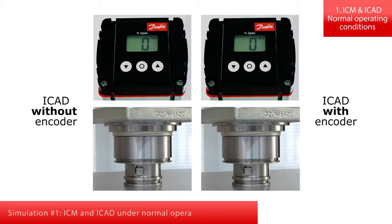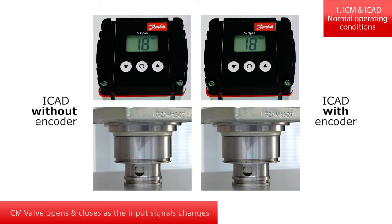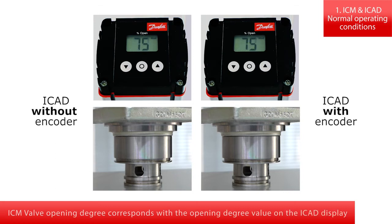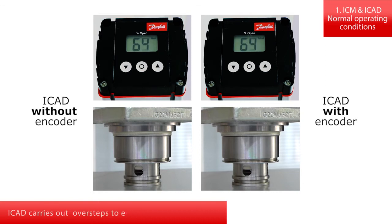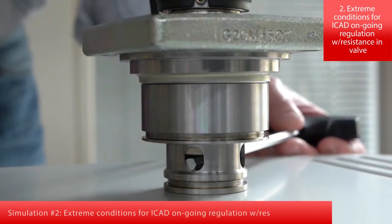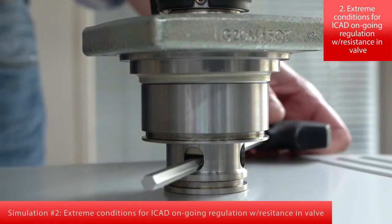Let's observe Simulation 1, where ICM and ICAD are operating under normal conditions. The ICM valve opens and closes as the input signal changes. The ICM valve opening degree corresponds with the opening degree value on the ICAD display. ICAD carries out oversteps to ensure the ICM valve is closed. Now let us simulate a rare situation when a foreign body gets into the valve opening, preventing it from closing.